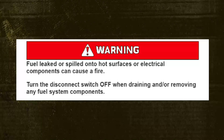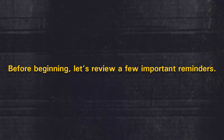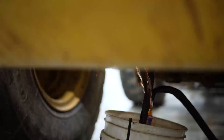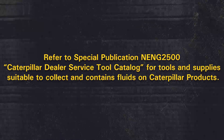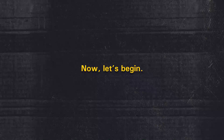An additional warning: make sure to turn the disconnect switch off and either shut off the fuel to the pump or drain the tank before proceeding. This will prevent mess, contamination and fire hazards during the replacement process. Keep all parts clean from contaminants, as contaminants may cause rapid wear and shorten component life. Care must be taken to ensure that fluids are contained. Refer to Special Publication NENG-2500 Caterpillar Dealer Service Tool Catalog for tools and supplies suitable to collect and contain fluids. Make sure to dispose of all fluids according to local regulations and mandates.